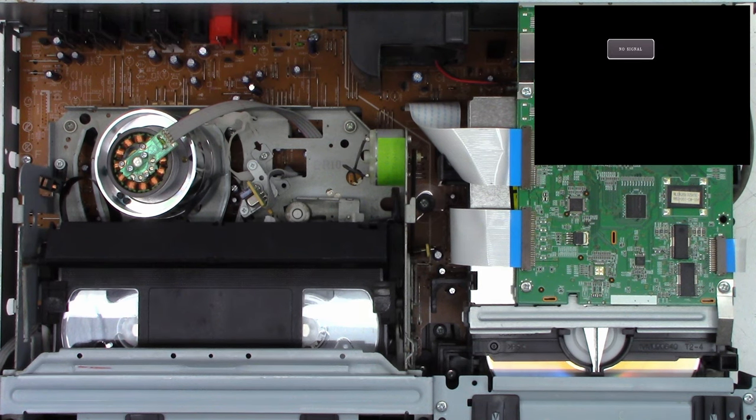And it definitely is deglazing the belt. They get a glaze on them that is very slippery over time. And I kind of want to keep doing this until the belt comes out fairly clean, which is normally 4 or 5 cycles here.